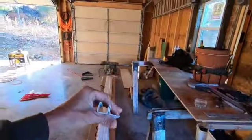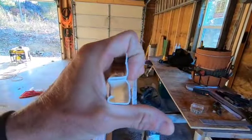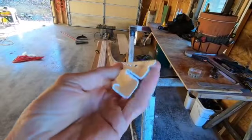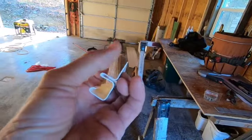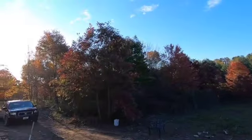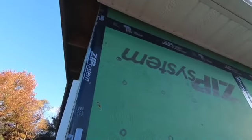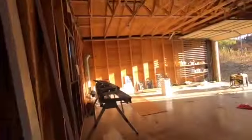Here's a full chunk — it's called F-channel because it looks like an F. It gets nailed up flat along the wall. I had to measure up one and three-sixteenths of an inch for this specific F-channel to have it come in level, then I just snap a line down along the whole wall at one and three-sixteenths up to keep it all nice and level. Then the soffit tucks into the F-channel.